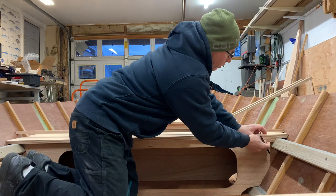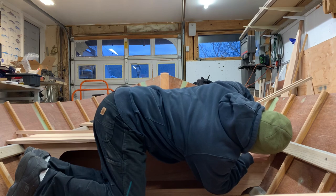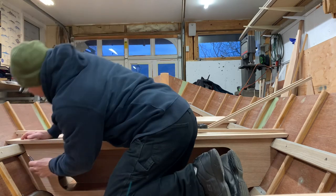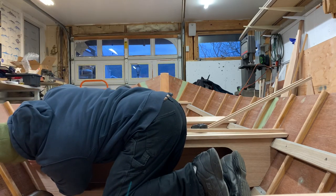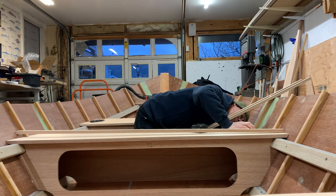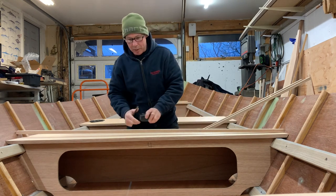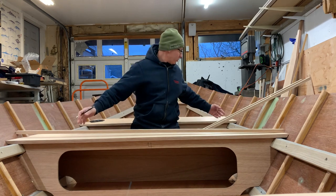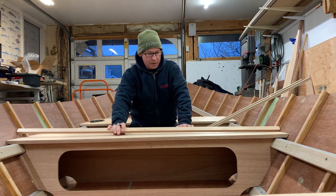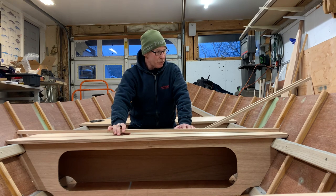So it's going to go right in that corner, and I'm just going to mark where those tips are. Like I mentioned earlier, anything in carpentry or boat building, you always want to start with your largest piece first in case you cut it an inch short — that way you can just use it elsewhere.